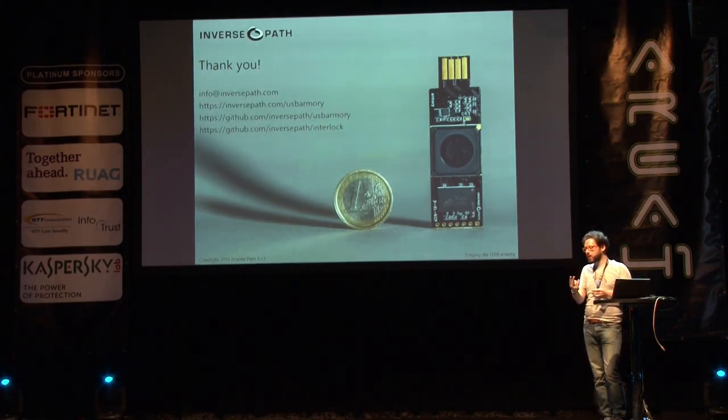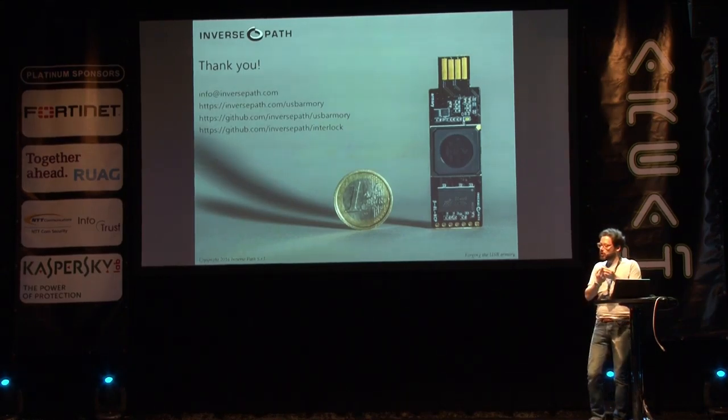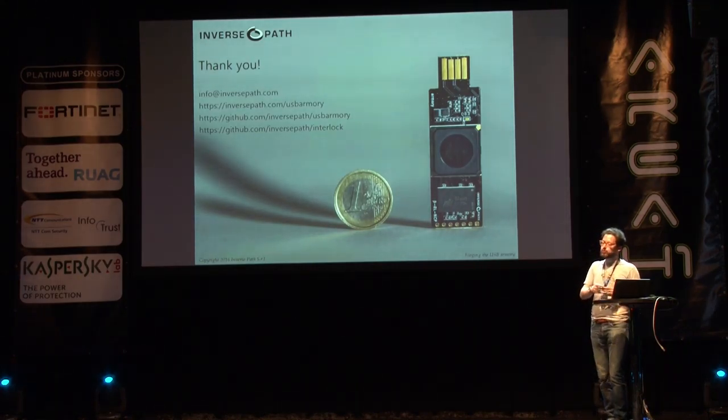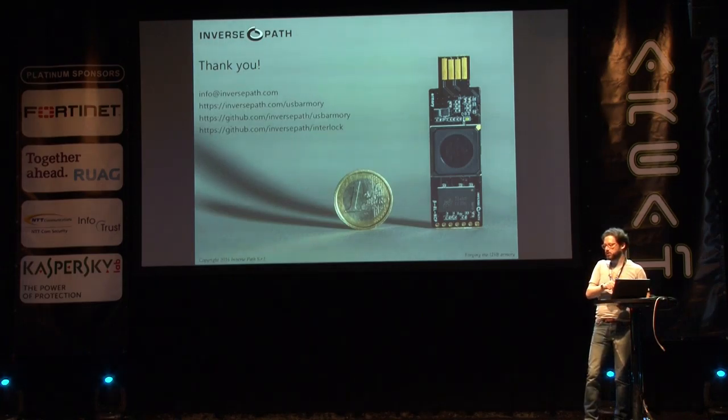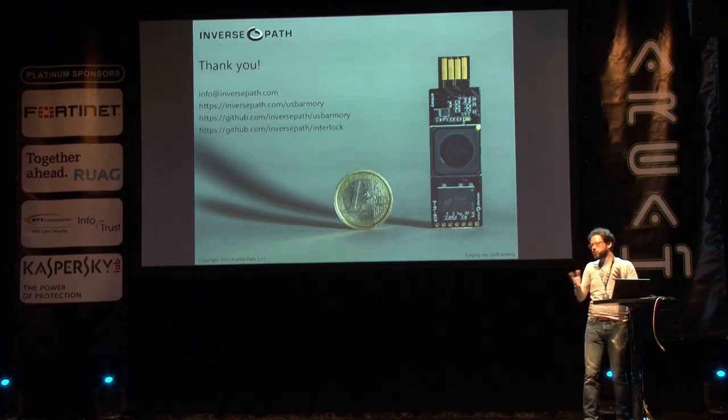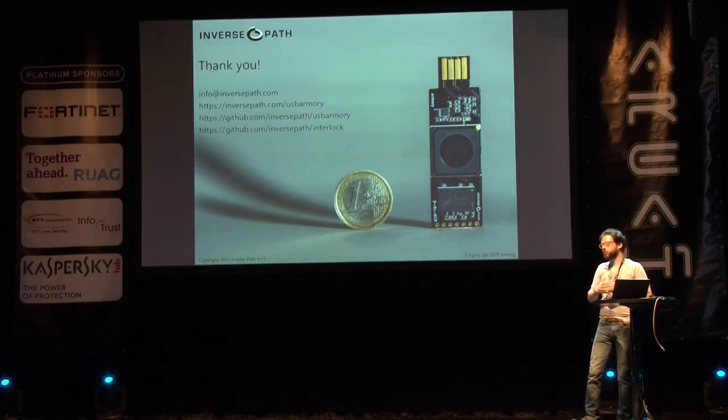And on this SOC, there are two ways. Either you fuse your key in the one-time fuses, and you make sure that your code does never allow external debugging to access those fuses, or you use the symmetric key, which is in the system on a chip, which nobody knows. I mean, you can use it, but you cannot know it, which means that when you provision the device, you need to use the actual device that you're going to deploy, which could be seen as a feature or it could be very inconvenient. But these are the two ways.